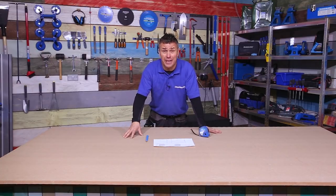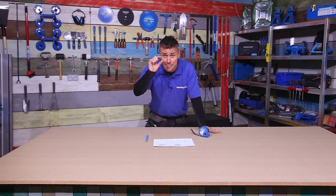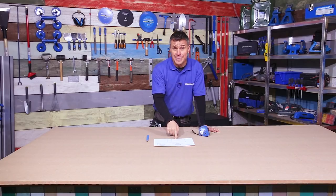I'm going to build most of the bed out of MDF. It's a standard sheet — eight foot by four foot wide and 18 millimetres thick, really easy to cut and easy to work with, and it's quite rigid as well. Once you've purchased your mattress and you know the sizes of it, you can draw your dimensions. The mattress I'm using is a standard one for a child's bed: 1,400 millimetres long by 700 millimetres wide.